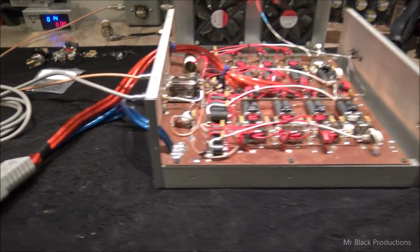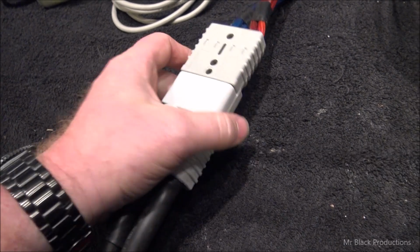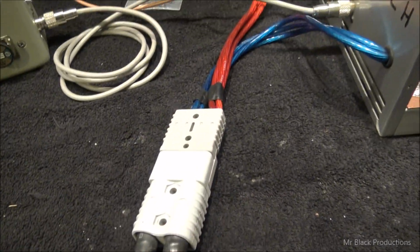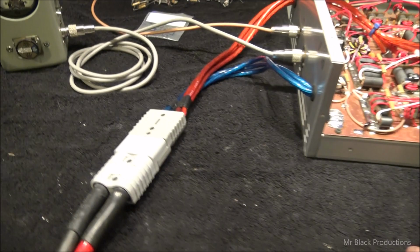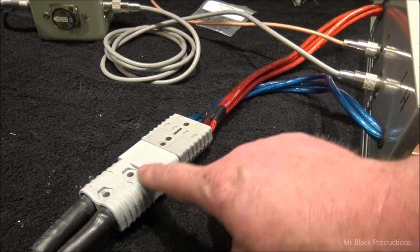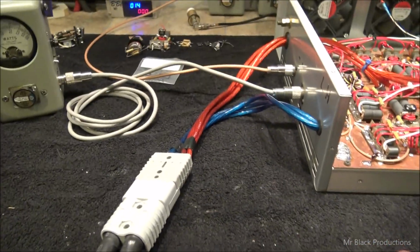The other thing I want to point out to you, Lee, is that this isn't very safe. This 150 amp Anderson clip, I would probably strongly suggest to you, Lee, that you replace this connector and go to welder twist locks. They can carry a whole lot more amps. After running this box for a little bit, you can sit there and look at the FLIR, and you can see from this connection on, going this way, the positive and the negative wires are incredibly warm.